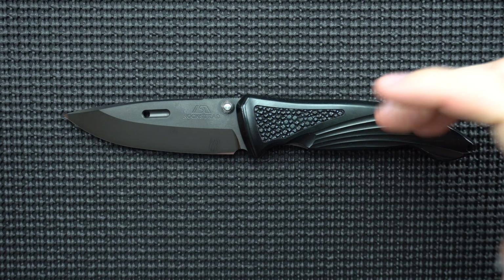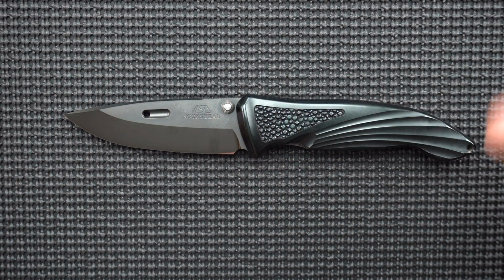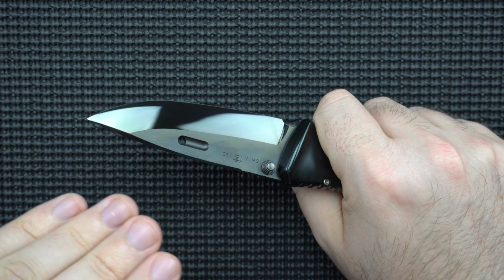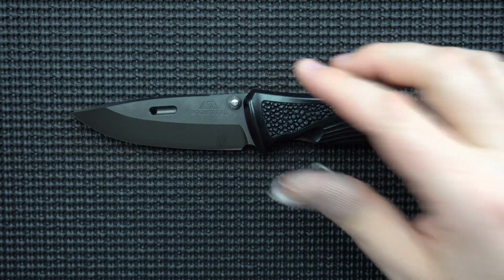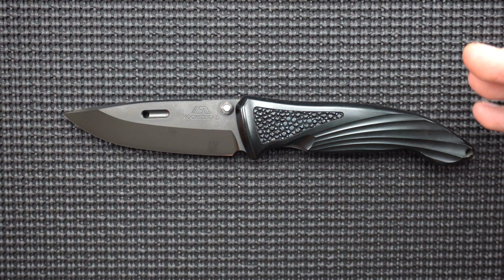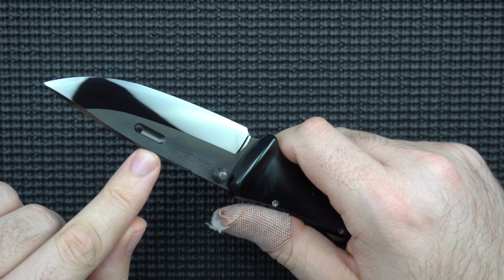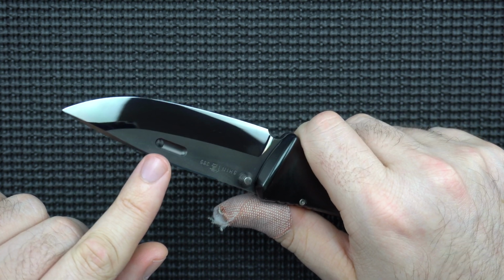And the hardness, they actually give you the precise HRC rating for this particular knife, and this one is 64.8 HRC. So combined with a very tough tool steel that's been heat treated perfectly and has a very high toughness, that is where they're able to claim these really crazy edge retention estimates. So from Rockstead, they're saying that because of this edge, the grinds, the steel, the hardness, and the heat treat, you should get about 2 to 3 years in between sharpenings, even with normal use, which is amazing. That's awesome.